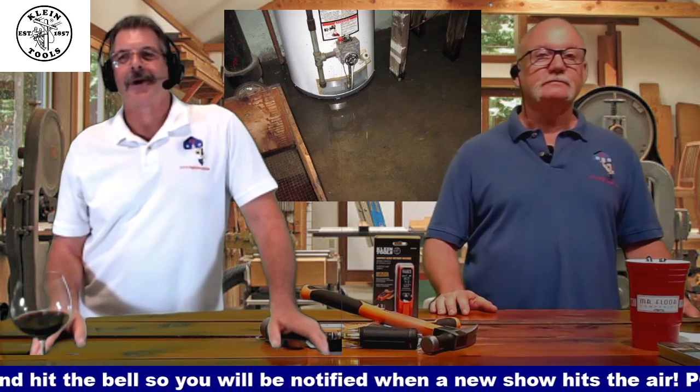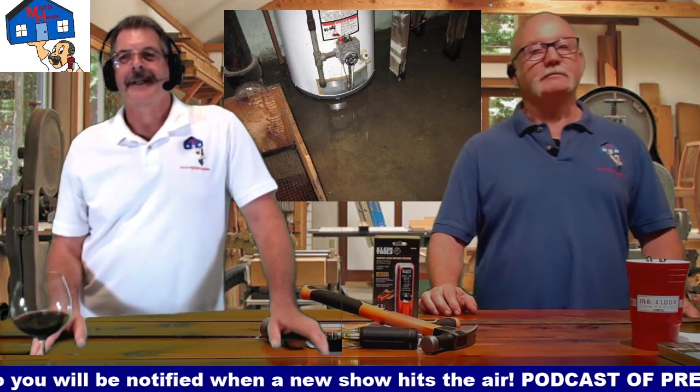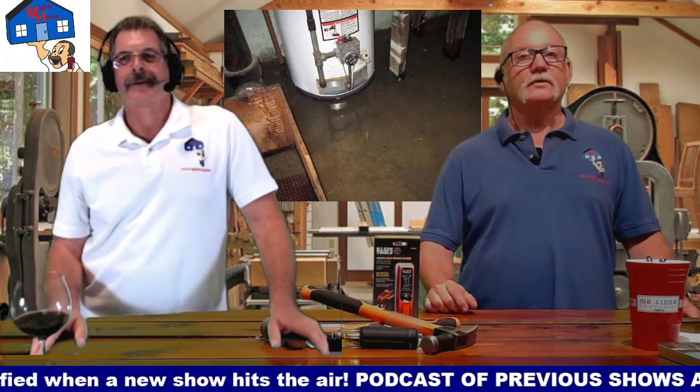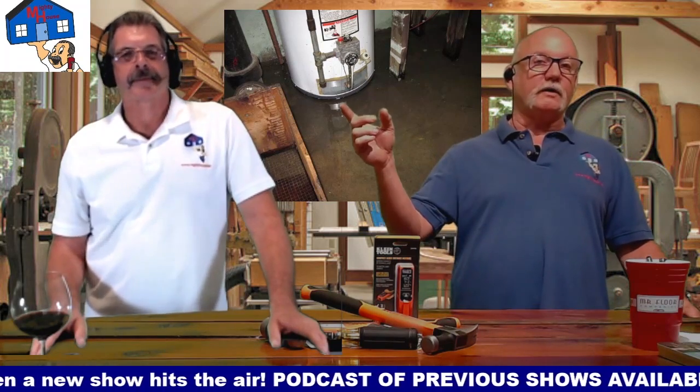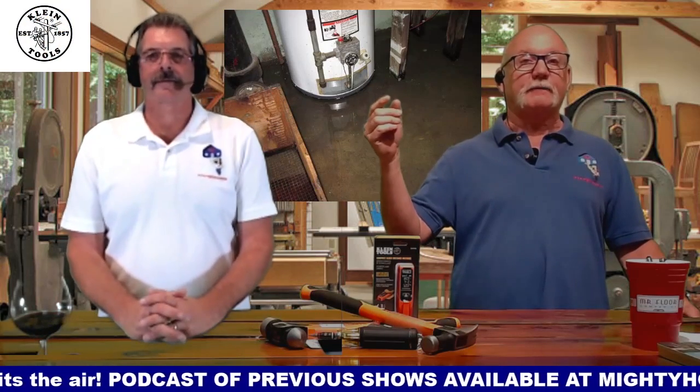I have a condensing water heater, and if I ever got it underwater, I'd pretty much just write it off. There are too many boards and things in them now. It's not really a water heater anymore. Correct. A basic water heater in a flooded basement you can fire back up. Some of the other ones you may not be able to.